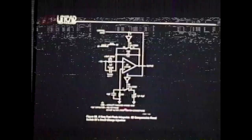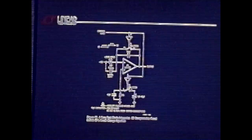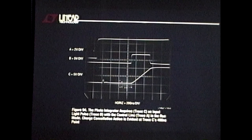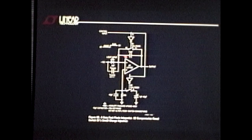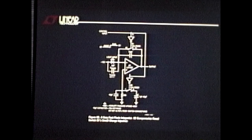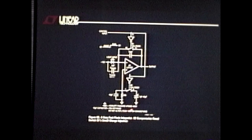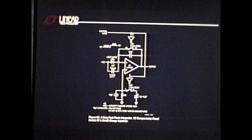A network of this type is best optimized empirically rather than in SPICE. You can tie yourself in knots trying to calculate it because these parameters aren't particularly well defined. The pin connections on the switch matter — if you use different switches in different sections of a package, that won't work because the IC layout is not absolutely symmetrical. Similarly, the physical layout itself forms part of what you're trying to compensate. If you tweak this up in SPICE and then tell your board contractor to build a hundred thousand boards, your company's going to be out of business.